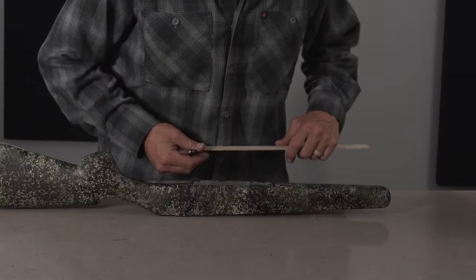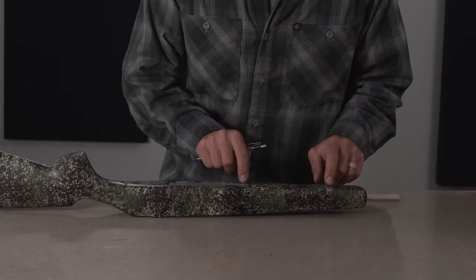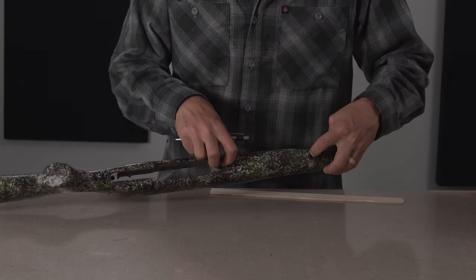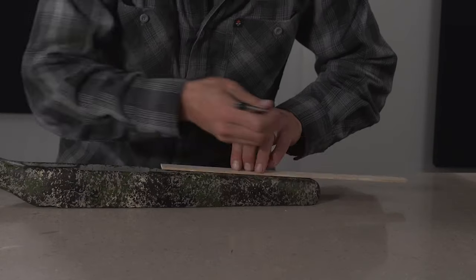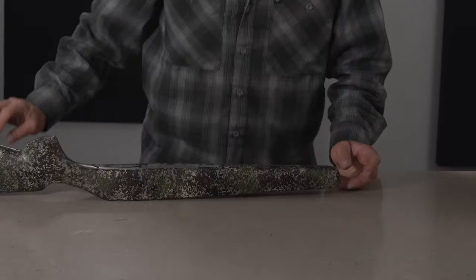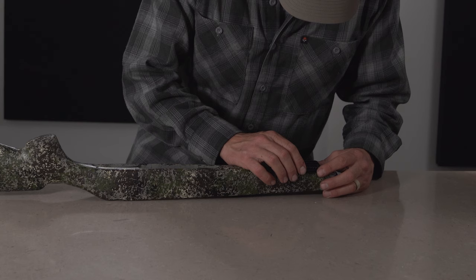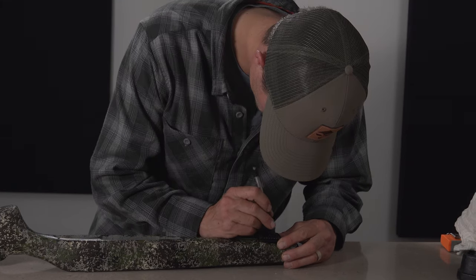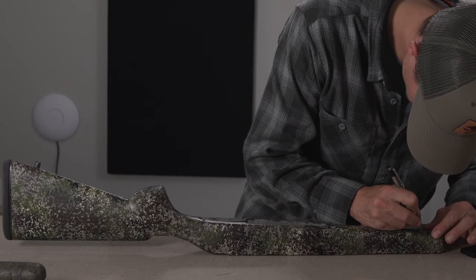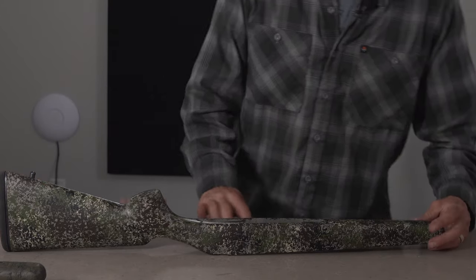I'm going to trust that the factory machined holes are dead center of the stock, so what I'm going to do is line up the dead center of this hole and this hole, drawing a line in between — so I have my line there. I line up this plate. There's already one hole in the stock where the sling stud went, and you can just replace the sling stud with a 10-32 machine screw, but I want to have a second hole to mount the plate so we have a much more solid connection.